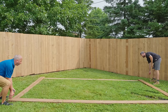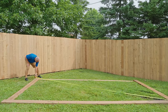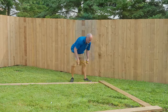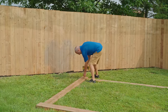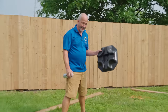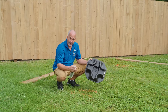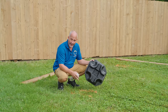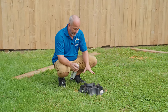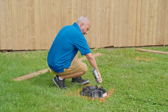Now taking my block — very important that you get rid of all of your organics when you're going to be working in this scenario. Get the grass, the black dirt if it's there, and then this will actually sit pretty much flush with the finished grass. Let's make sure we make this big enough.